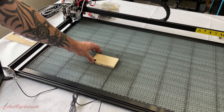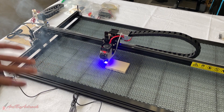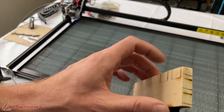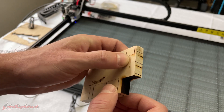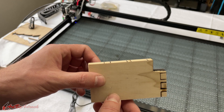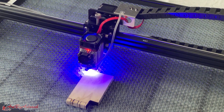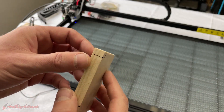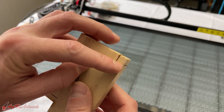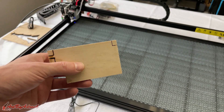This does produce quite a bit of smoke — I have my window open so it's venting out. That second attempt still didn't make it all the way through; it's right on the edge. I think if I slow this down to 50 millimeters per minute it probably will cut through, so let's give that a try. Again that still didn't cut it through — it went farther but didn't slice all the way. So let's see what I actually need to do, maybe try two passes at 100 millimeters per minute.